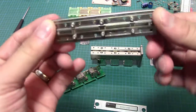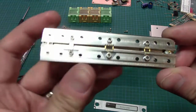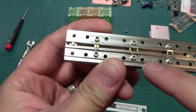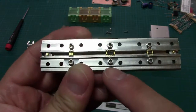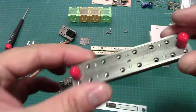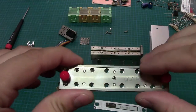What was different were the pads. So in this particular model that I bought off eBay, it did not have a 10, 20, and a 40 pad. It had a 5, 30, and a 40 pad. Whoops. Yeah, so of course when I put that in, the output became whatever it wanted to be.